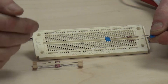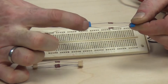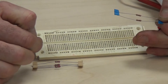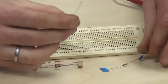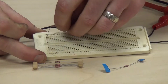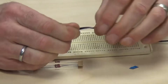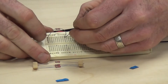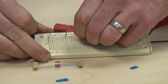I've selected a couple of different resistors. In other videos there's an explanation of how we define resistance values based on the color coding on the resistor. At this point, we're going to do a physical measurement of the values and then do the calculations for voltage drops across a series circuit. I'm going to take these resistors and lay them out in a series circuit on the board, starting in one quadrant and jumping to the next, making sure to stay in the same row to maintain the connection.